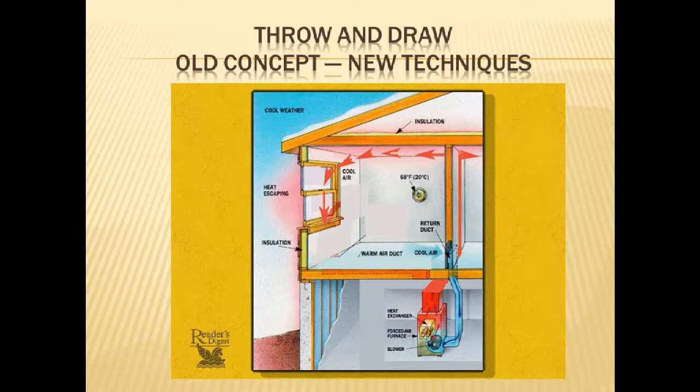And so you may see some radical changes coming, because you can imagine what's going on in the basement. You've got that ductwork running all over the place trying to get to the under the windows. If we don't have to get it there anymore and we can run it all up the middle of the house, you've saved a whole bunch of space and trouble and even cost of ductwork. And you've done it by a more intelligent use of the fans, the ductwork, and the grills. And so you're actually measuring these things so that the air can get out there.